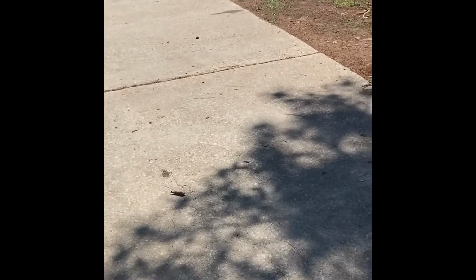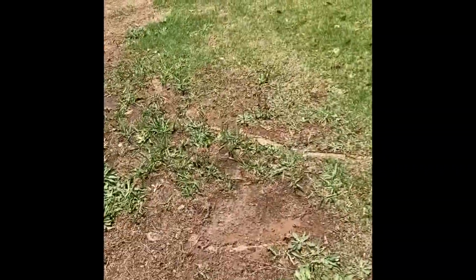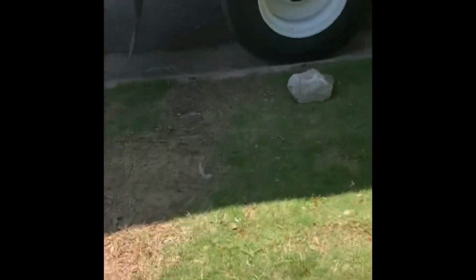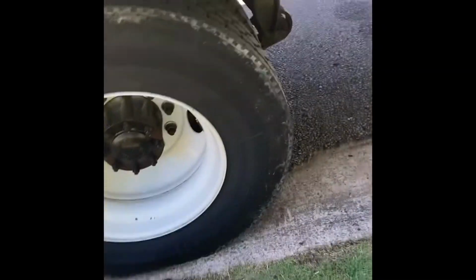Of course, you want to check your tires. Make sure you got a lot of meat on them. If you got recaps, try to put your recaps on the outside. Just a little thing a mechanic told me. Put a good tire on the inside, recap on the outside. Reason being, if your recap blows, it's going to blow on the outside and it won't destroy too much. And whoever comes to replace the tire can replace it from the outside versus the inside.